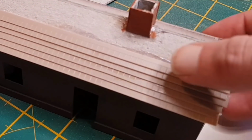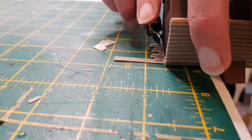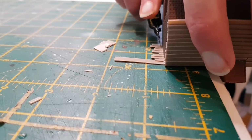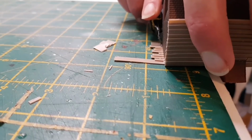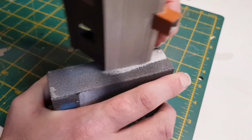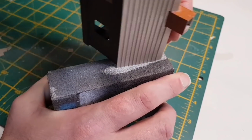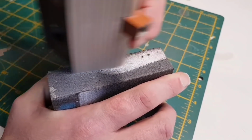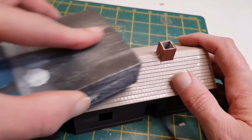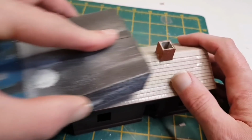And also don't forget to stagger the strips too. All the excess is then trimmed away once the glue is dry, and then sanded straight for a nice smooth finish. I also sand the ridge flat, as this will help the fitting of the ridge tiles a bit later on.